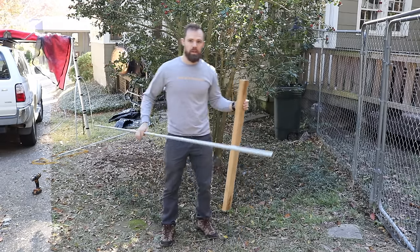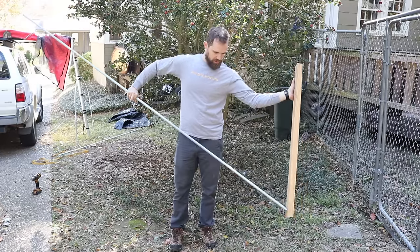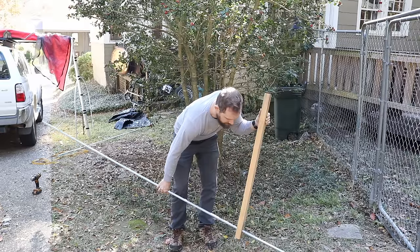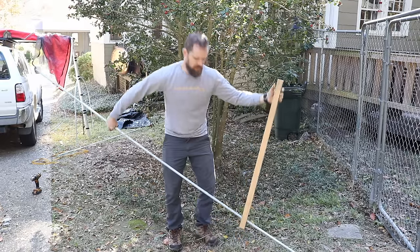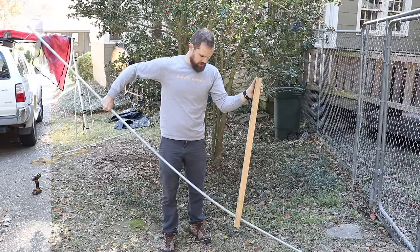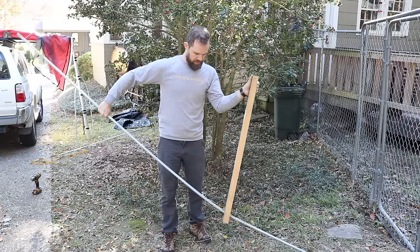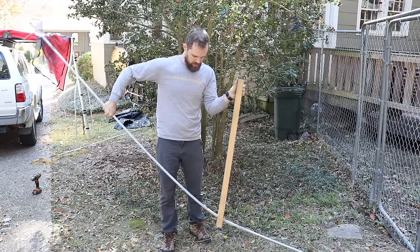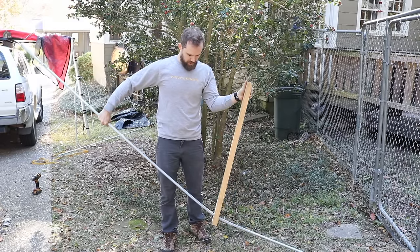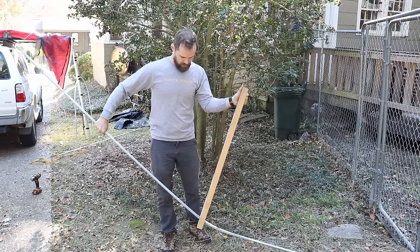What you're gonna do is take your conduit and your piece of wood with your hole in it. You're gonna feed it through to that mark that you did. You're just going to use leverage to make a bend. You're going to pull it towards you and just barely bend. And just work it about every inch or so and just slowly do it. Don't overdo it. You'll put a kink in it. If you just go slow, you won't kink it. Just keep going